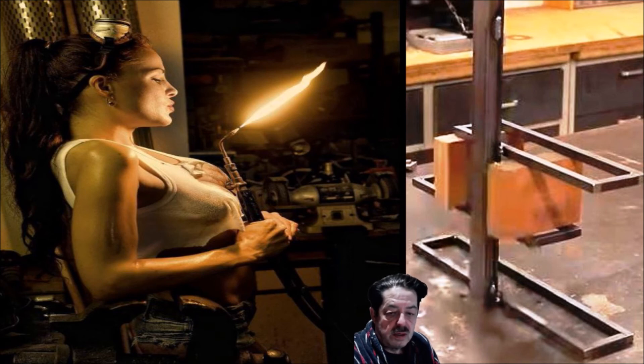Next question: flat steel warps the easiest. I cold-rolled one-inch one-eighth — yeah, it can do that. My advice to keep it from warping is to do more spot welds, then worry about coming back and doing that continuous nice dime-shaped bead and making things look pretty and perfect. The more you do this, the more you practice, the better you're going to get at it.